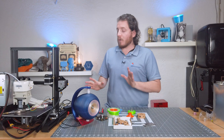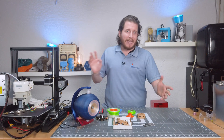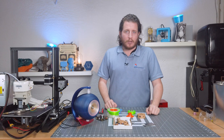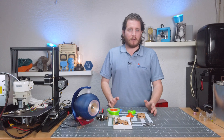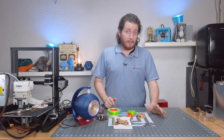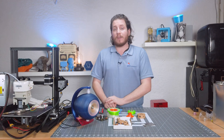We're actually only able to provide this with about 40 watts worth of power. Assuming it's maybe 80% efficient, we're getting roughly 30 watts to the speaker, so 15 watts per channel — which is perfect for a speaker like this. We're not going to overdrive it. It will get way louder than you think it should, because these are actually pretty darn efficient speakers, all things considered.